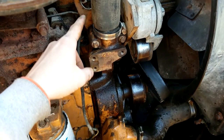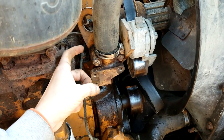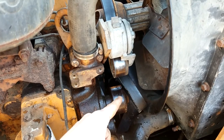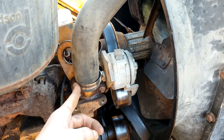Alright, so I just put the engine lift bracket on, followed by the housing that holds the thermostat — there are three bolts. Now I gotta put the bracket that holds the alternator, the alternator, hook the fan belt back up, and tighten that hose, and we can give her a start.